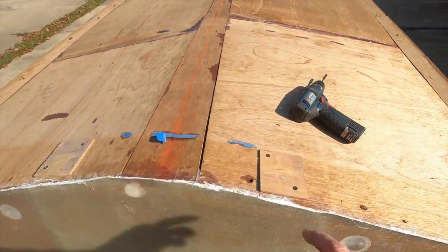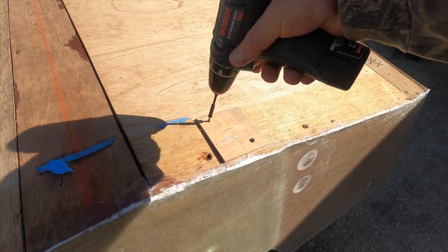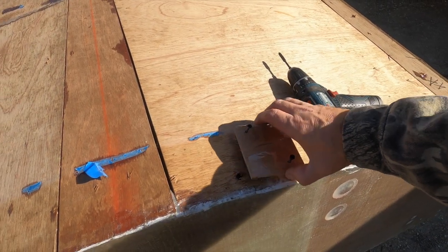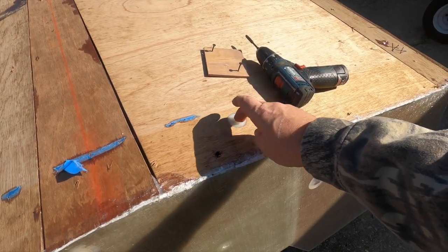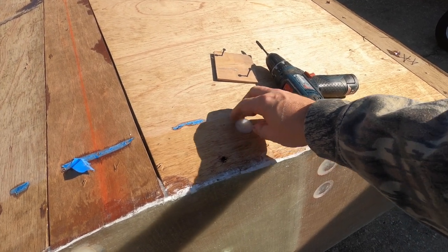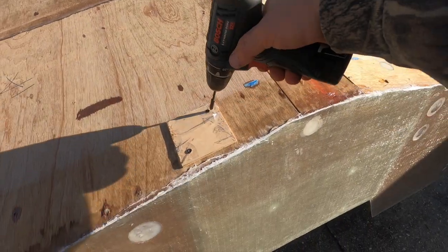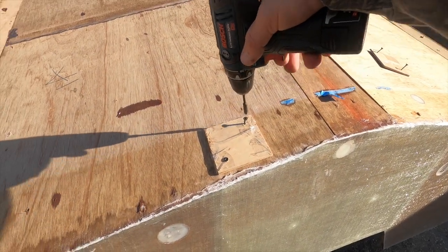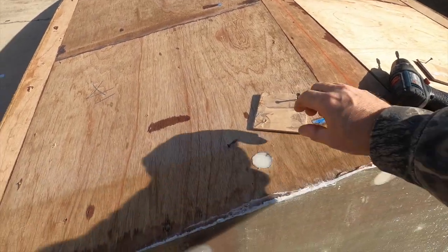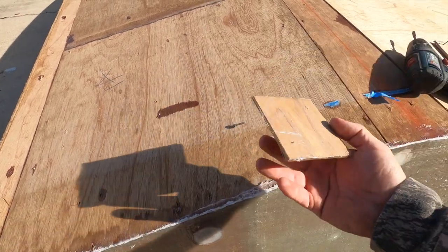Here's where I drilled the seacocks. Take this off — see, it's just a little piece of five-millimeter laminate — and that's where the through hole will be. The high-speed pickup is actually going to be a strainer scoop. I'll have one on each side. I'll show you what that looks like on the top side — I might put another one in here.